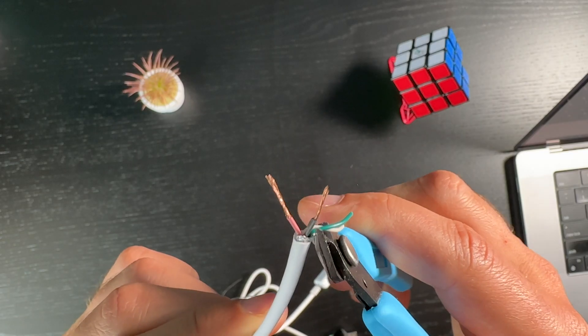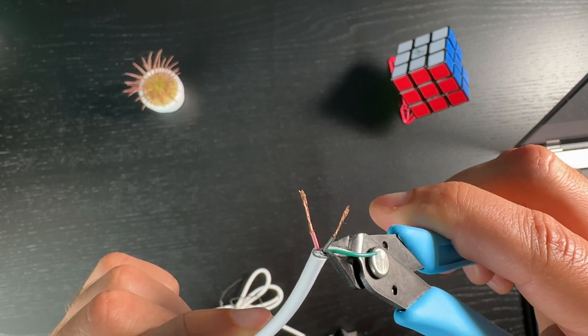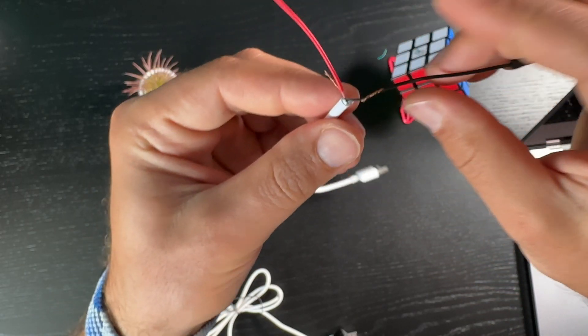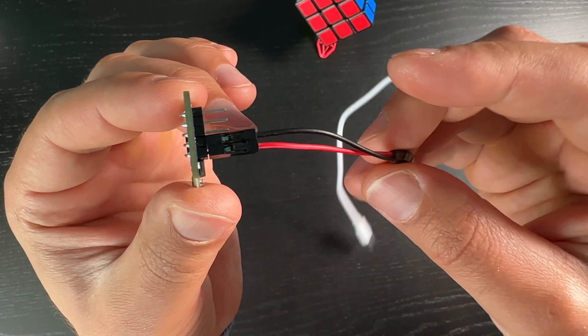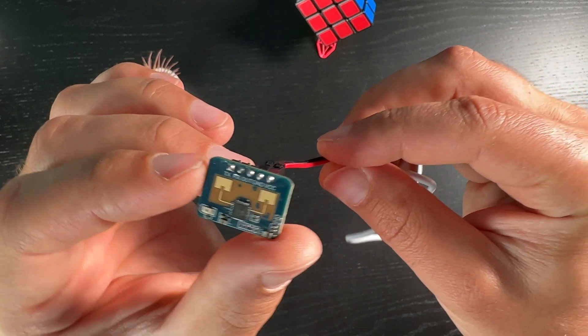These sensors are not battery powered. To power them up you only need a USB cable that you cut, then connect the red and black wires to the VCC and ground pins on the board — and that's it. You now have a great presence sensor. I'll leave some affiliate links in the video description if you want to make one or more for yourself.